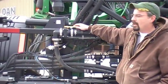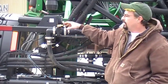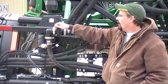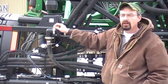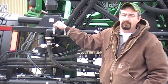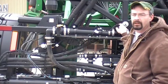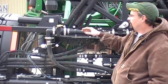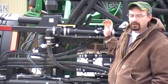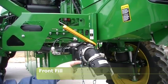As you go further down the line we also have an orifice valve right here. When we're shutting it down we're not actually shutting anything off — inside this valve is just a smaller drilled hole. When you get below 26 gallons per minute of pump flow we're going to orifice this down; it holds a little back pressure in the system and this makes our flow meter a lot more accurate. If we get above 26 gallons per minute we open the valve up and it's just like straight flow out to the boom.